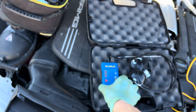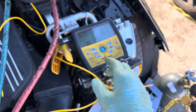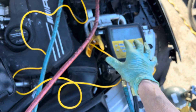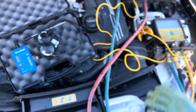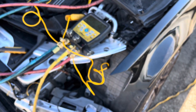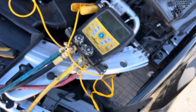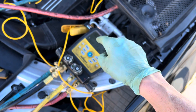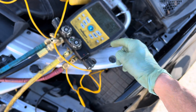In this case I'm going to hit it with the ultrasonic leak detector even though it says it's not leaking — and there it goes, it's back at zero again. I do it anyway because I always want to make sure. A lot of people say you're just wasting your time, but I like to do things two or three times. I'm not a high-volume franchise that needs to kick the car out quickly — I have to make sure my customers don't have comebacks because of something I passed up.